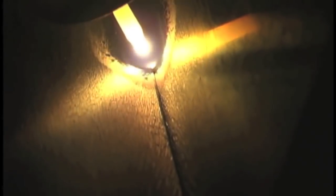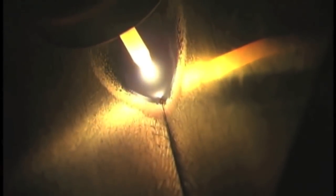But when you're dipping rod in and out of a puddle — like right here, I'm just running a bead on plate — that puddle height grows. So you can see subtly I'm kind of raising the electrode up while I add rod to get it out of the way. Here's another shot of aluminum using a tapered electrode; I can get right down in there really tight. But if I were adding rod and keeping a tight arc, I'd have problems. So I pause and raise the electrode and torch up just a little bit, lengthening the arc while I add rod to compensate for the puddle height growing. Same thing on a butt joint — I'm holding a tight arc between dips, but as I add rod I pull my electrode away a little bit. I clean a lot fewer electrodes that way.